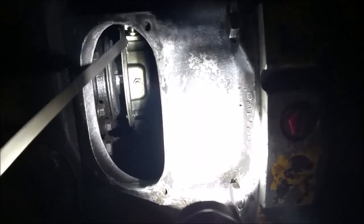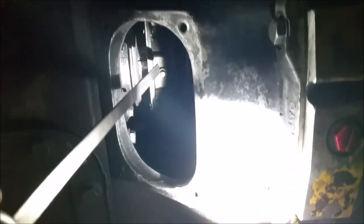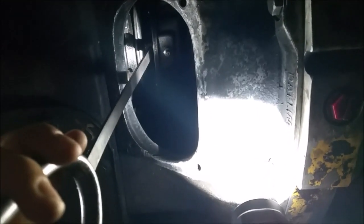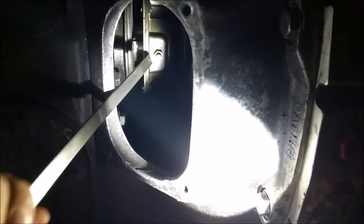Now the next thing I'm going to note is the grease fittings. If you look, this right here is a grease fitting. There's another one here. There's also two on the outsides which are kind of a pain to see, but there's one there and one over here — way up top. When you grease these grease fittings, you're going to grease them until you see grease come out from the bearing itself. You don't want to over grease it. You're going to want the grease to come out because it has to grease this clutch brake — the clutch brake will not work without grease. So make sure that every time you do a clutch adjustment, you grease this clutch.